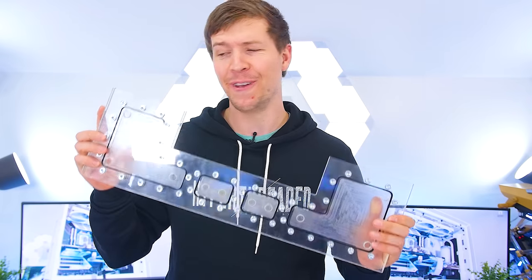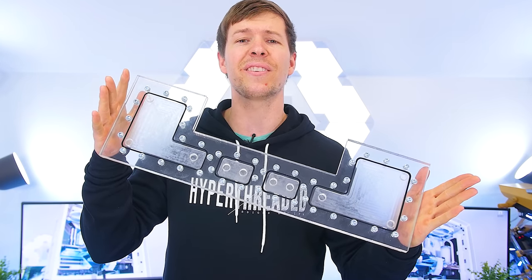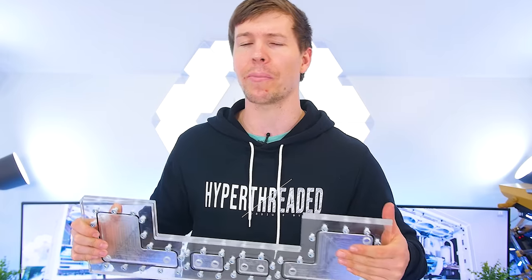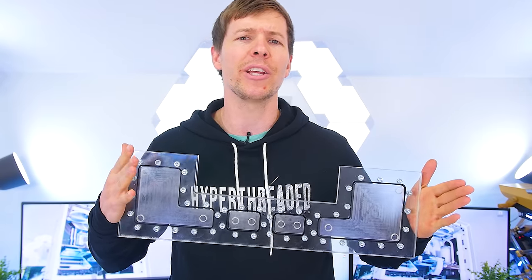We have finished our distro plate. We've fully leak tested it — we actually used the EK leak tester, which is such a handy tool. I recommend this to any of you guys who do water-cooled PCs. Instead of having to leak test your system for 24 hours, you can put this on and wait 15 minutes to see if the pressure inside drops at all. I'll leave the link in the description, along with links to the specs this computer is going to have. Now that this is finished, we can move on to Progress 5 where we will be starting to paint and work on some of the aesthetics of the build, trying to make it a little bit more steampunk-ish.